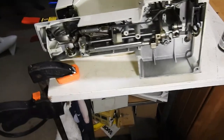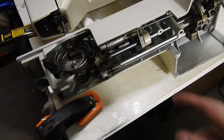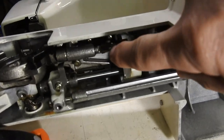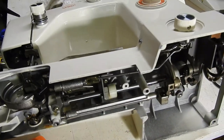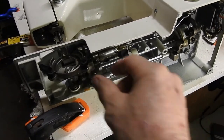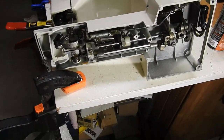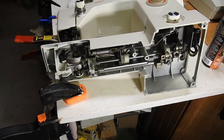We're going to have to do a lot more lubing and soaking. The feed dog drop release has a little bullet right there — similar to the Kenmore — a bullet that shoots in and locks the feed dogs up or down. That thing is completely stuck. That's always the big problem on Kenmores too when they're stuck: only sewing in reverse or feed dogs won't release.